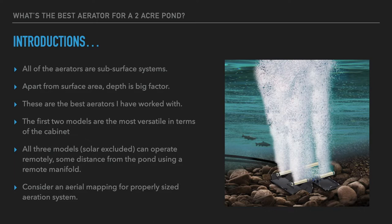We know that we're talking about a two-acre surface area or maybe something a bit less. Surface area is a given in this context, but the real variable — and maybe the most important number you have to keep in mind when fitting an aerator to a pond — is the depth you're working with. The deeper a diffuser can be placed, the more pond area it will affect. Conversely, if you don't have as much depth, you may lose coverage and have to increase the number of diffusers to turn a shallow body of water over adequately.